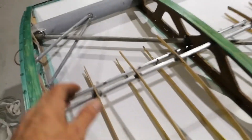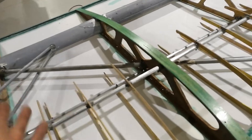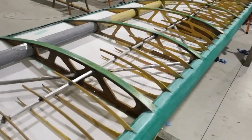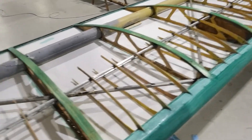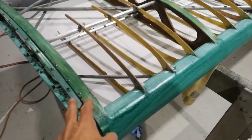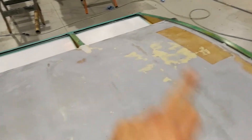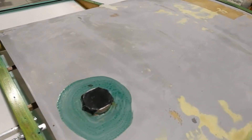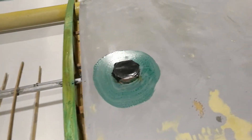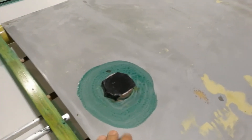We're working on the top side now. You can see I've got the fabric on the underside just glued in place with the first stage of shrinking done — no cap strips yet, just the lower skin on. Now I'm working on the top, and then collectively I'll put all my tapes on. This is a Kitfox Mark 4 wing — pretty much the same wing throughout, just less under-camber than the early models. With the Stewart's glue, you put it down and let it set. I used a hair dryer or heat gun. I've got a glued area here around the fuel tank — on my other Kitfox I had ribs to elevate the fabric off the tank, but in this case the tank is almost flush with the ribs, so I'm leaving it as intended. I'll put a glue band here which is already tacked off.